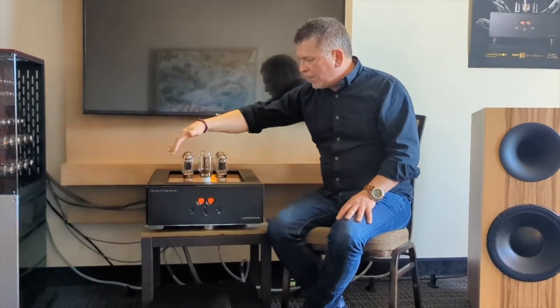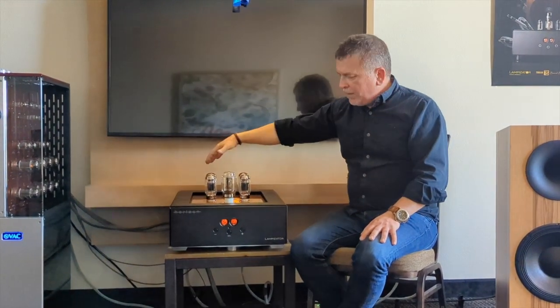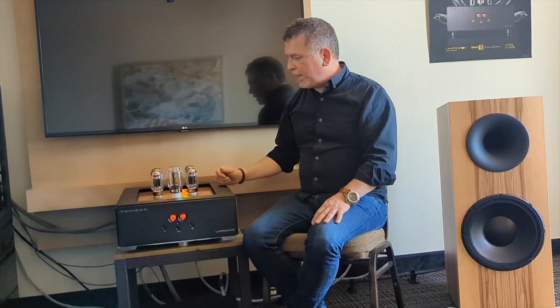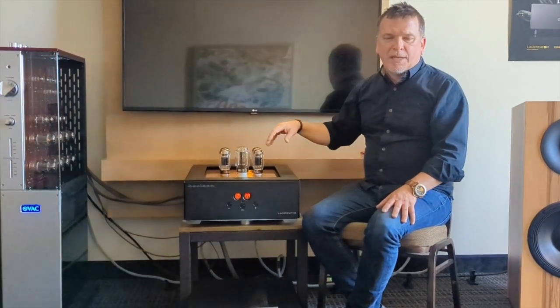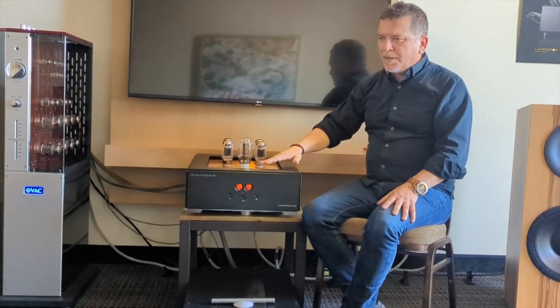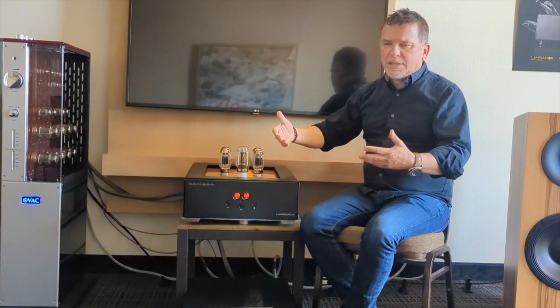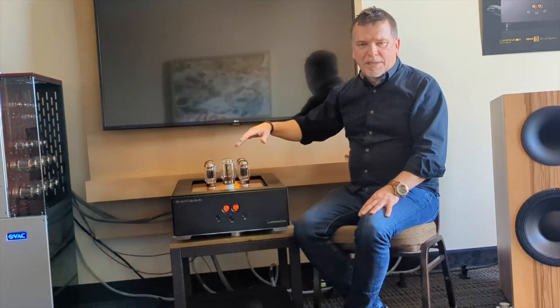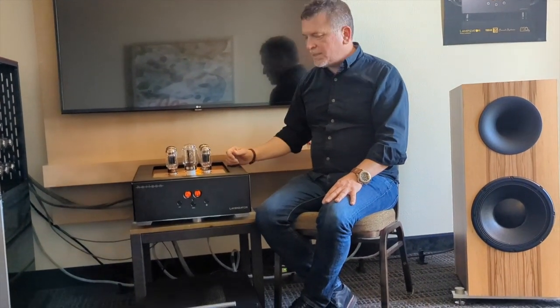And then the whole area is one giant PCB on the top, which is the analog section holding the tubes. Again, every function is separately fed from a separate power supply. Every tube has a heater from a separate winding and separate power supply. And there are also relays, muting circuits, and all the functionality for power slowdown, as on a switch-on cycle, the voltage is rising slowly, the heaters are rising slowly. All this is managed by the microprocessor or by specialized circuits.